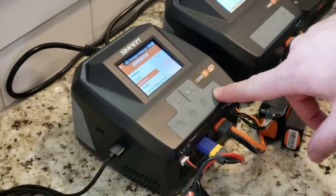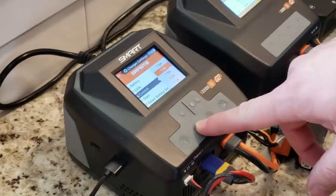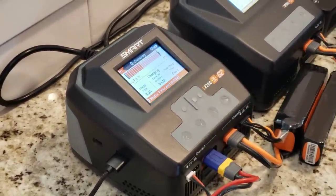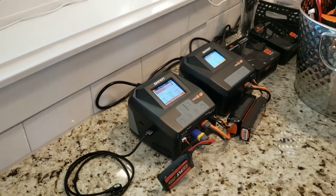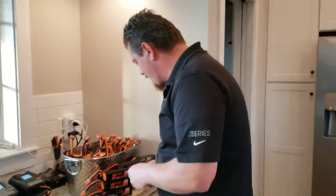we have to set the current, and we'll have to set that each time, which is 1300 milliamps. So, whoa, it's already 1300. That's pretty cool. That's just pure luck though. You know why? Because we happen to be doing a 1300 before. If that would have been a 5,000 milliamp hour, it would have charged at 5,000, or you would have had to change the setting. Not a big deal, not hard to do. You just gotta remember to do it.